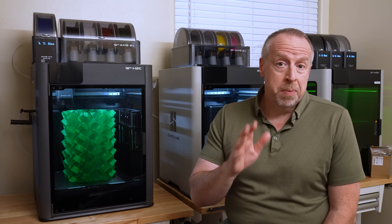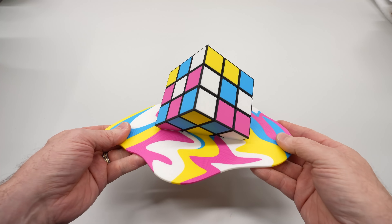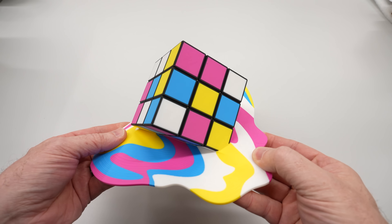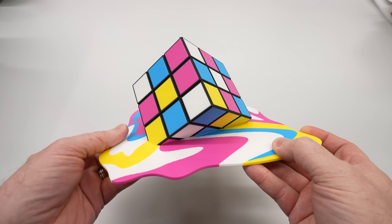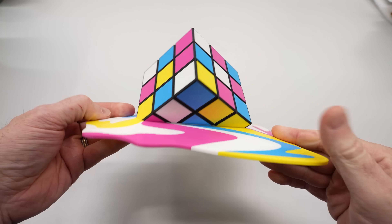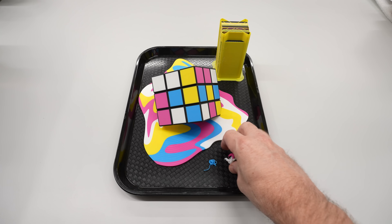The answer is it depends, but if you're doing big multi-color prints it can be a lot. This is the melting Rubik's cube model by Malty. It's a five-color model with all five colors on most of the layers. With default settings there are more than 2000 nozzle swaps, so it's a pretty good test of the system. This print went smoothly — no jams or miss-picks, just a nice clean print. The model itself is about 375 grams and the tower is around 190 grams.